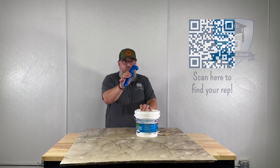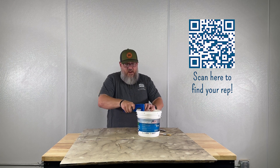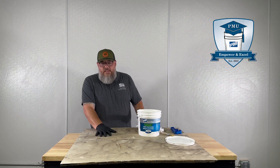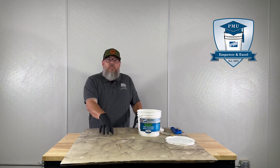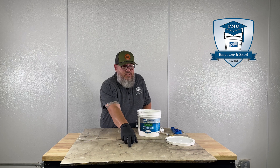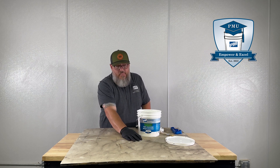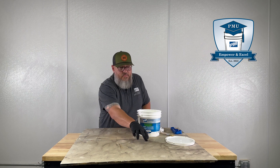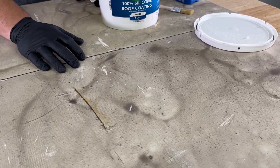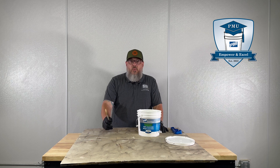By the way, if you reach out to your regional manager, we have tons of these bucket tools that our marketing department would absolutely love to send you guys. What we have here is a sample board with TPO that's already been primed with our P-151 Primer. As you can see, our marketing guys applied a little bit too much in some of these dark areas. We'll do a video on this later, but FYI: if you see these dark spots when applying P-151, you're going heavy and it could cause adhesion issues. We'll talk about that in detail on our P-151 Primer video.